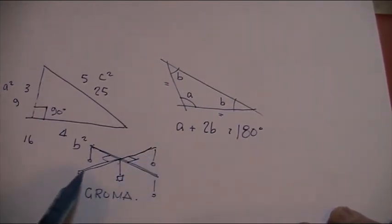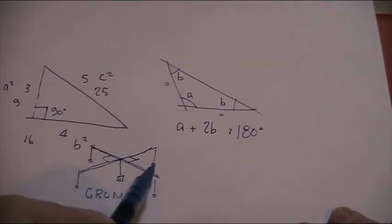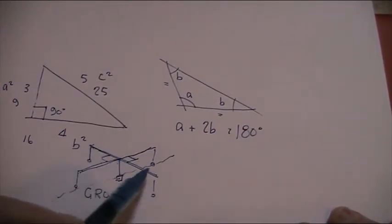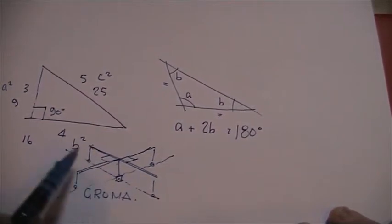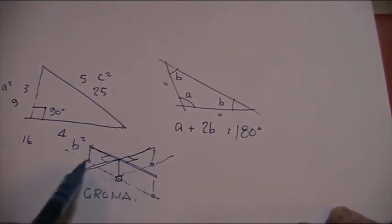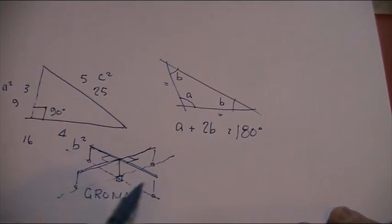So this whole thing would be set up on the posts such that all of this would be vertical, and such that when you viewed between one bob, the centre bob, and the next bob, you'd have a straight line. And obviously therefore, if these are maintained at 90 degrees, when you viewed and sighted down the other side, you'd have another line. And so this piece of kit was sensitive. You needed to ensure that this was always at 90 degrees, and it was the head surveyor who would look after this piece of kit, and as far as I can understand it, I've not seen anything to contradict this. This thing was transported as a fixed piece of kit.